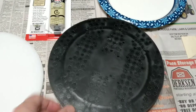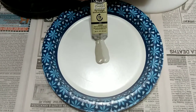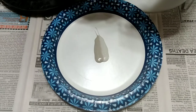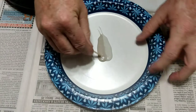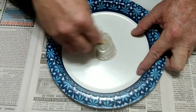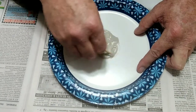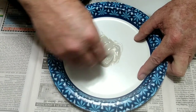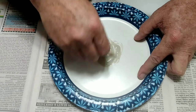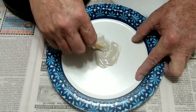We're going to apply a little bit here and then drop the driver on. I'm going to put a couple of clamps on and let them hold it while it's drying. There are other plastic glues that will work fine — I looked at several of them, but the problem is their set time is so quick. This sets in 15 minutes and is basically cured in 30, so it gives us just a little bit of working time, which is what we need.